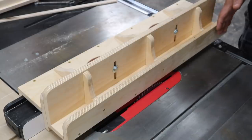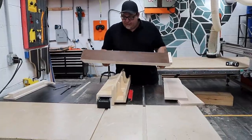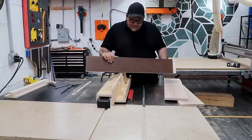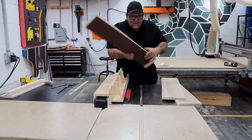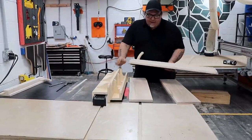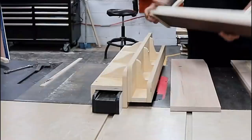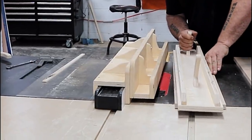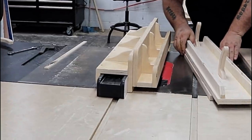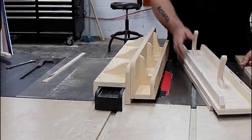This is why it's sometimes called a flush fence or flushing fence. You take a square, line it up with one of the teeth of the blade, and bring the fence right over the top of the saw blade and tighten it down — so now the fence is flush with the saw blade. I can use a large straight edge push shoe to do straight line ripping cuts. It's basically a really big push shoe with some anti-slip cork rubber on it and a stop position. I can line it up with the material so it's sitting a little bit over the edge, run it through on this fence, and it's going to cut it flush for a perfectly straight edge.